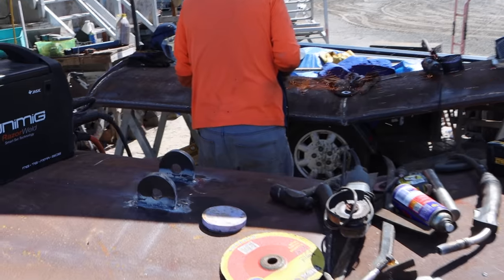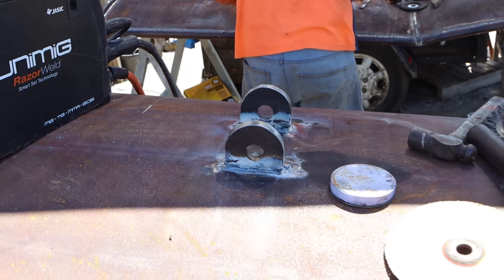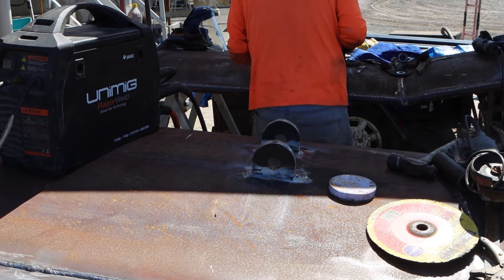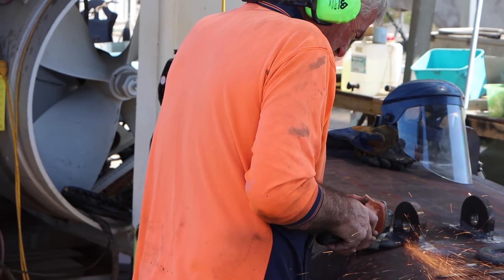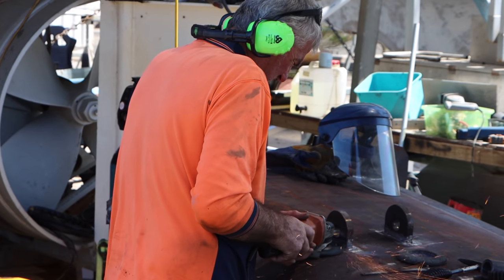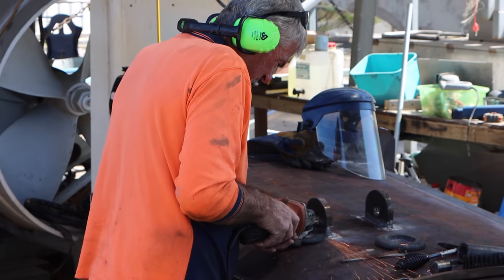We got through and welded these gussets in. We had to weld around all of that, paying particular attention not to put any undercut into the corners of those mounts. I've had advice on how to stress relieve the corners - if you weld around and get undercut in the parent metal, it creates a stress point that a crack can start from. So I did all that hard work making it strong underneath the skin, but if I ruin it at the skin level, theoretically those mounts can crack at that point and break off. What Trev's doing now is called stress relieving - radiusing any undercut using a grinding disc to get the bulk, then a round-edge flapper wheel to clean up.